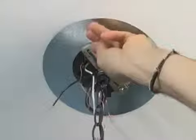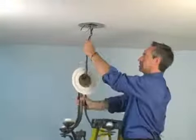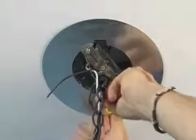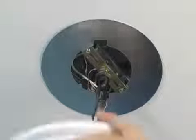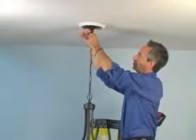We're going to install the first screw and then the second screw. Now the chandelier is hanging off the bracket and we can make our wiring connections. Be sure to make all electrical connections according to code. We're going to tuck our wires inside the can, then lift up the decorative medallion and place the canopy, securing it with the screw collar ring to make sure everything is flush against the ceiling.